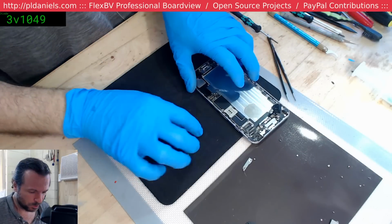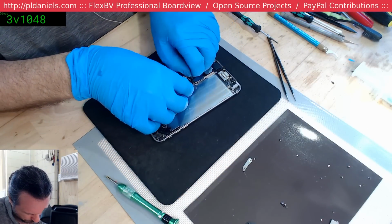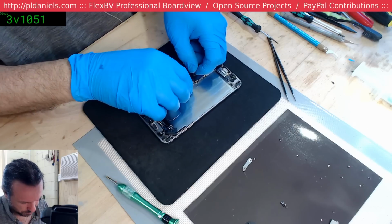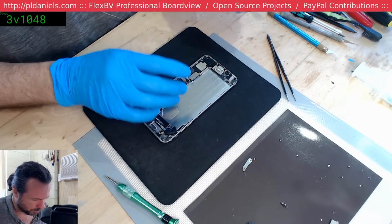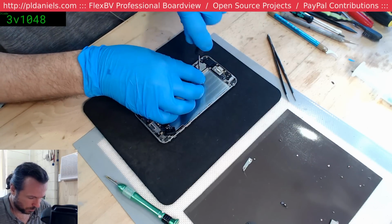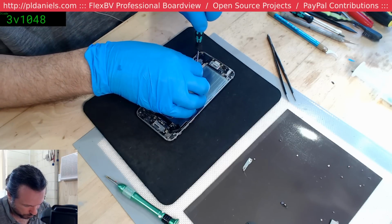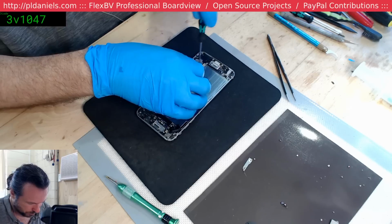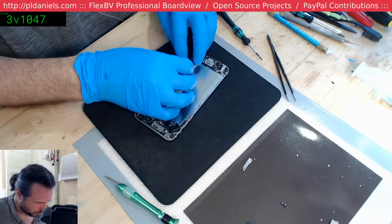Hot air could potentially help. I say potentially. Could also make things worse, because the aluminium will actually probably expand faster than the steel. Which, yeah, I suppose if you heat the frame, it should let go of the steel screw a bit faster, but I'd consider it to be subjective at best.